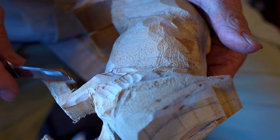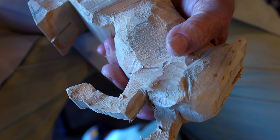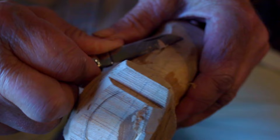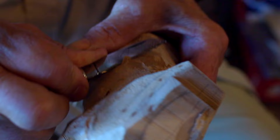Most of the time when you're cutting, I've got the grain of this wood running down this way for the strength in the legs and the tail. On the mule head, I have the grain of the wood running with the ears and the nostrils — mainly the ears. When I cut away from myself, I put the thumb on the back of the blade — thumb on thumb — and you rotate your hand. That makes it a slicing cut. You don't just push it; if you push it, after about 15 minutes your hands are shaking. So you slice like this.